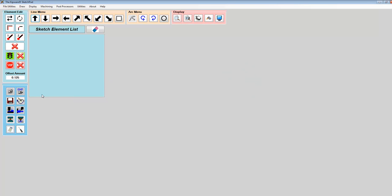The first thing we're going to do is get the sketch pad up and running. Everything in the sketch pad, even though it's a turning program, is currently drawn using X and Y coordinates. We're going to draw the finished profile and then describe to the software how we want to rough it and then finish it. The sketch pad has a feature called AutoPath, so we don't need to know the tangency points on the 250 radius and the 40 degree angle — the software will automatically calculate that for us.